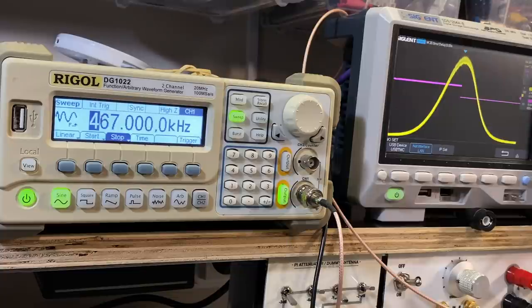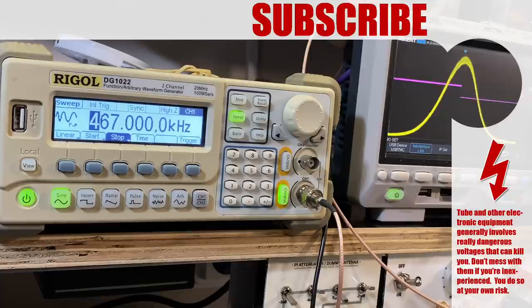I have one more step to do — IF alignment of the FM — and then we'll see how the RF alignment is. If it's not too badly off I probably won't touch it. What you're seeing on screen is precisely the joining of all the passbands, all the bell curves of the respective filters, creating a clear path for the IF frequency. I want to thank you for watching; if you've enjoyed that click like, share, subscribe. And if you want to support the channel directly, you can do so on Patreon. Bye for now, stay safe.